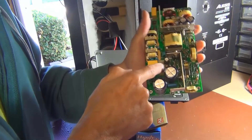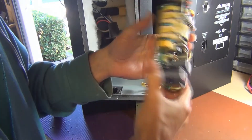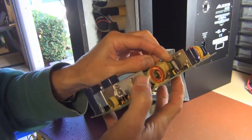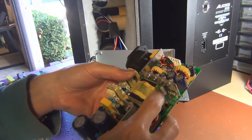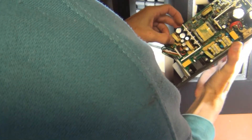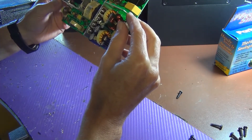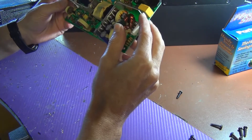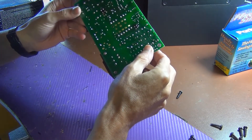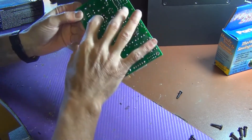Now this is exactly where those two resistors are together here. There's an enormous amount of heat that's been generated off those two, and also at this point on this resistor here as well. I'm just going to take a look at the right-hand side one and have a look at that resistor. It's pretty much the same thing on this one too. I'm going to look at the board with the magnification glasses on to see if there's any other noticeable things. Yeah, that seems to be the main issue — there's excessive heat at this point here.